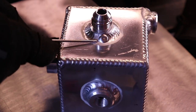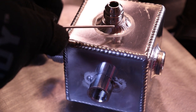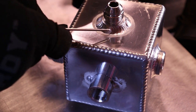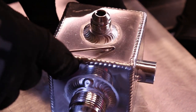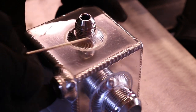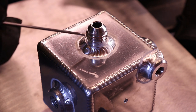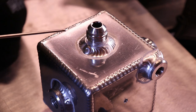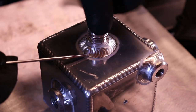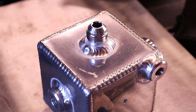This one I did all vertical up. You can see right here I ate that lip out because I was at a bad torch angle. After that first pass I kind of hit my groove, and everything started working out. A lot of times I'll have to do vertical up on these because they'll already be tacked into a boat, up in something. So I'll just run it uphill this side, switch around, and run it uphill this way.